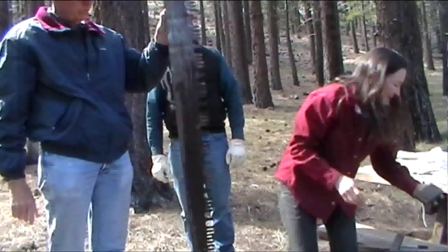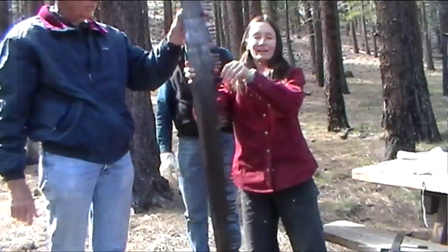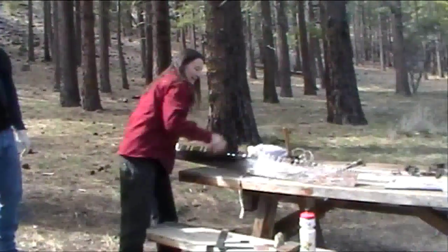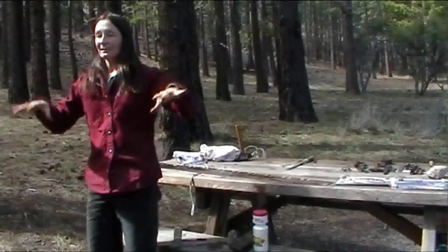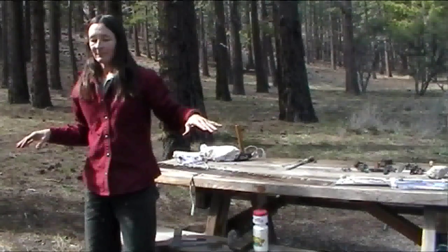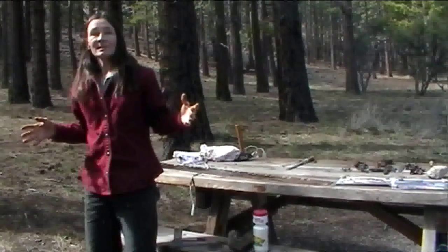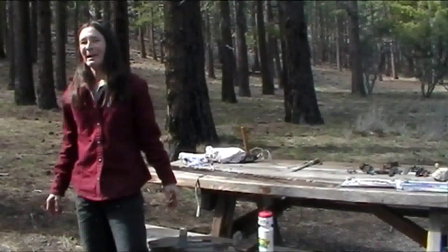The first time I asked somebody about how to straighten a saw, I really regretted asking — they said I needed a saw doctor's leveling bench, a slab of mild steel two inches thick, six feet long and a foot wide, mounted on a solid wooden bench, plus a set of straightening cross-peen hammers costing about $250 each, and then I'd need to learn how to use all that equipment. I just thought, that's not going to happen for me.